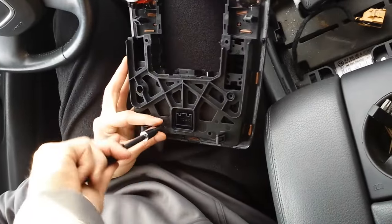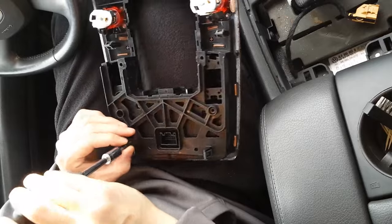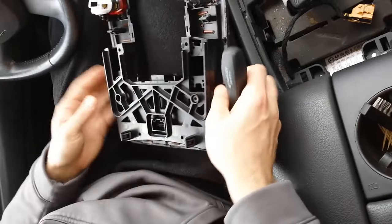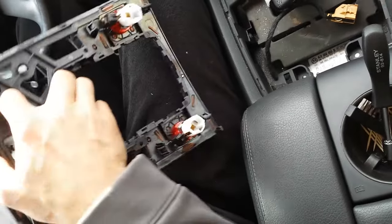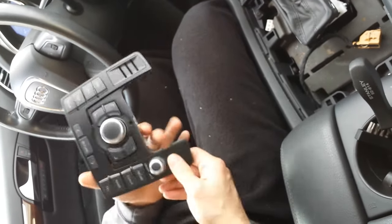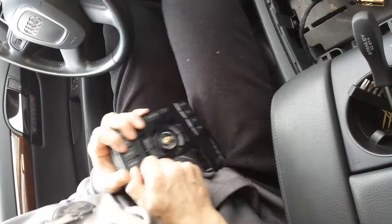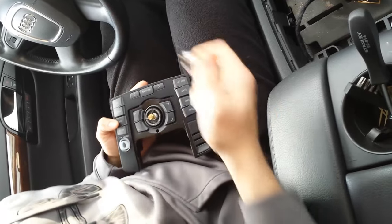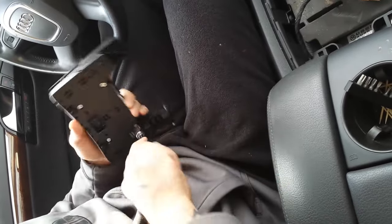Now I have taken the board out. I did try to clean it as best I could with a couple of alcohol swabs but it didn't work. What I think I'm going to do after this is soak the board in isopropanol alcohol — apparently it doesn't wreck it. So now we've freed this. There's the controls — there's those last four screws and then we have access to the boards. They will not come out unless you take the knobs off; they just pull off. This one is a little harder to pull off but it does come off. So there we go — four more screws.